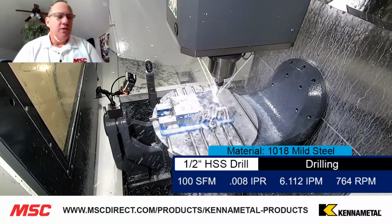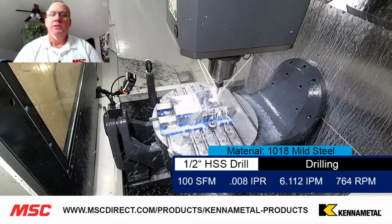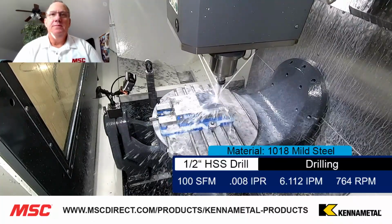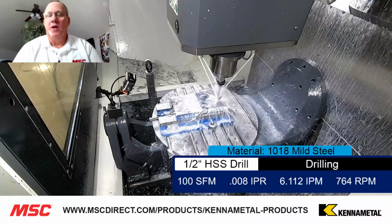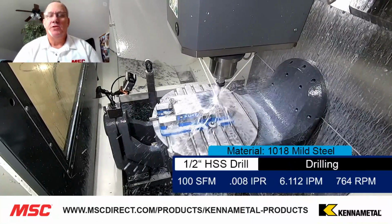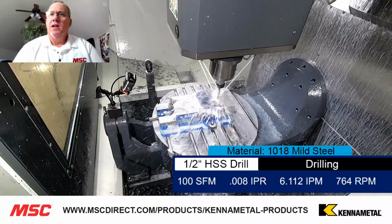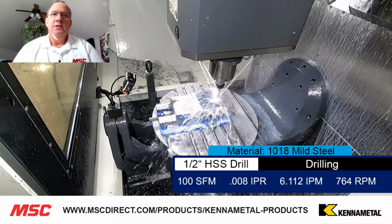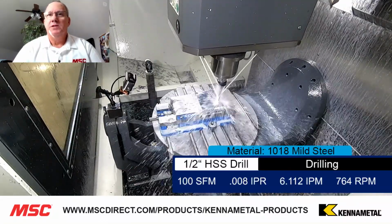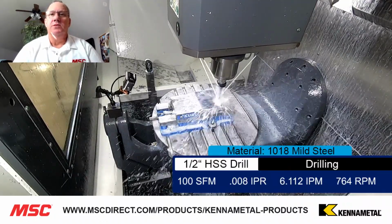So, high-speed steel drills are something everybody has. They've been a staple for many, many years in shops, and kind of a go-to thing. They go grab it. They can grind it themselves, which also can create issues unless you have extra equipment that you use for grinding the drill point. There's not a lot of technology in the drill at all. Again, they've been around forever. It takes a lot more thrust to push these high-speed steel drills through materials, but you can run them in a lot of different materials as well.